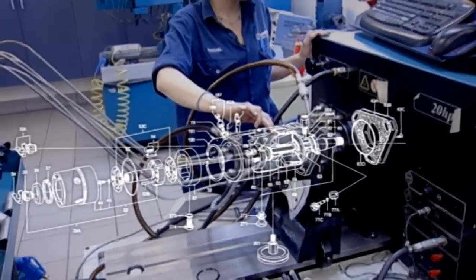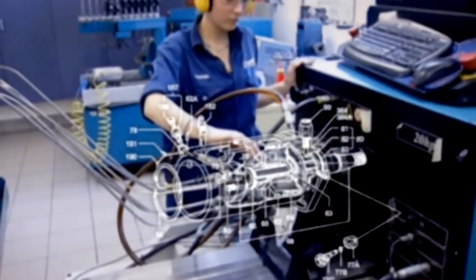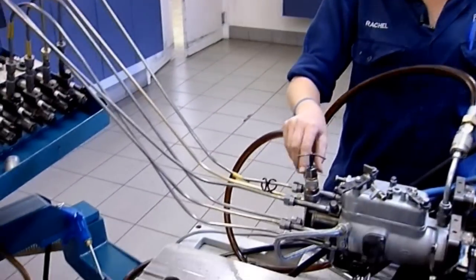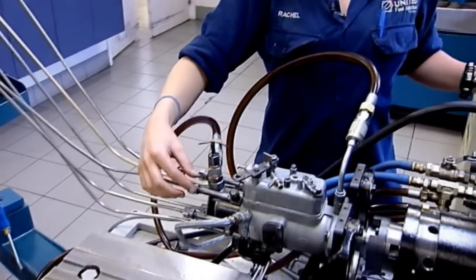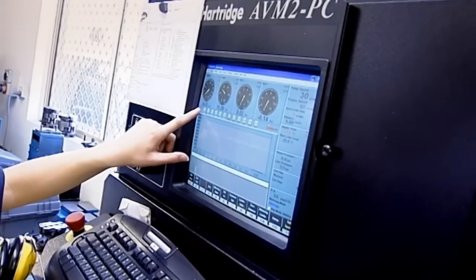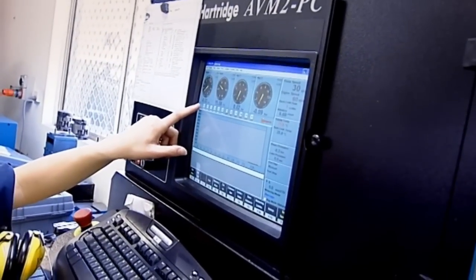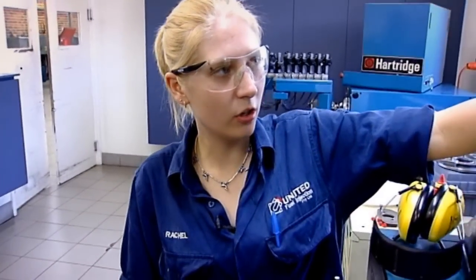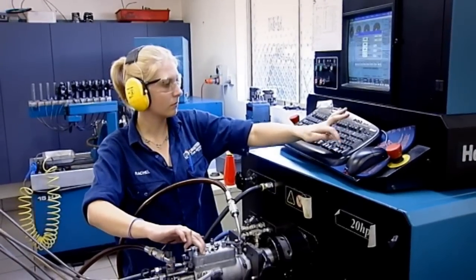What I'm about to do here is run up this DPA pump to test it and calibrate it. The test fluid comes through here as the pump goes around and injects the fuel through these pipes into the injectors up here. This is our supply pressure, and this would be for boost pressure — we actually use compressed air on the test bench to simulate turbocharger boost.